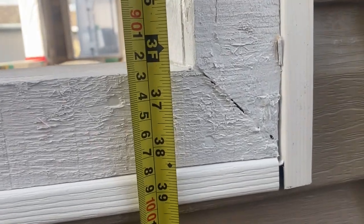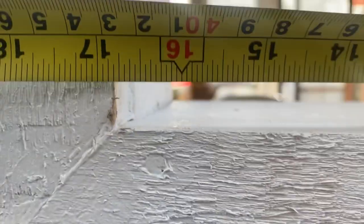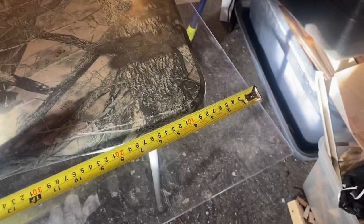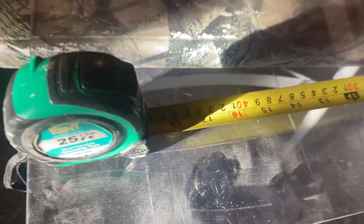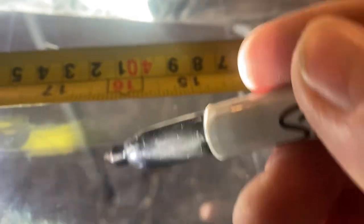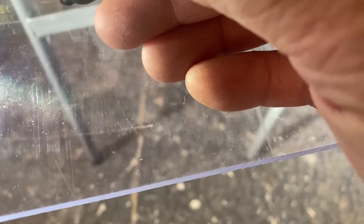So that's what I'm going to do. Now let's do the width. The width of this opening is around 16 inches and seven-eighths, roughly. I have my measuring tape now set up on the edge of the plexiglass. The measurements for the opening is 16 and three-quarters. So I'm going to mark that off using my Sharpie — at the 16 and three-quarter inch mark.